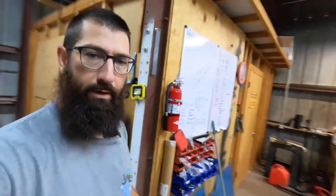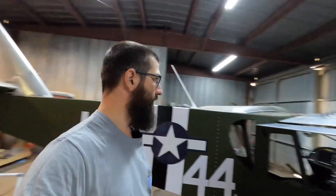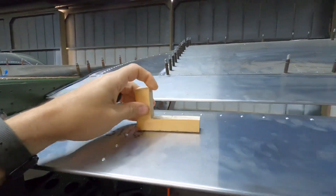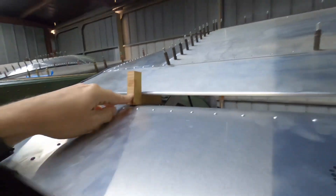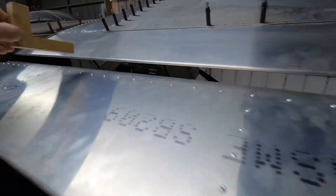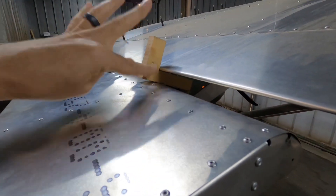To do that, I did make up a little tool. According to the plans, we have to have a block that's about 19 millimeters for spacing. This tool here is 19 millimeters plus or minus two, and it should fit between like so — inside along here. I checked it at both mounting points, and that's set.